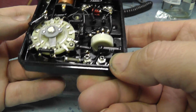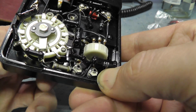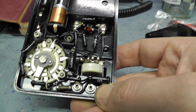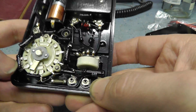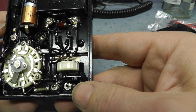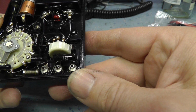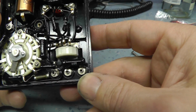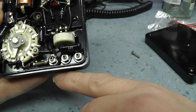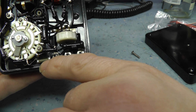The switch, as with the Taiwanese meter I showed you earlier on, is lovely. It's got a real nice, solid, chunky feel to it. Lovely build quality switch contacts. They're not going to become noisy quickly, they're not going to wear out. So that's a really nice switch, nice build quality. Wire-wound resistors for the low values. These are the sort of things that you often find in these meters that are burnt out.